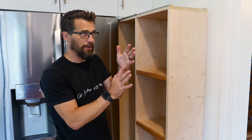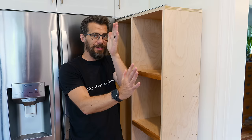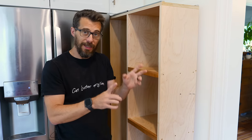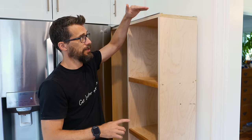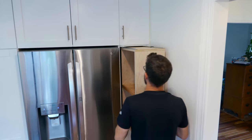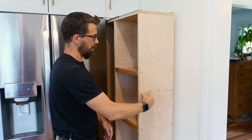I had to switch gears a little bit, and I found that having the drawer slides on the back of it allowed it to move this way and this way. And it was really hard to get all that stuff lined up and in there. So instead, I put the slides on the top, and there's actually two of them you can see up here, and that guides it forward and backward and tries not to let it turn as much. Now, the wheels in the bottom are parallel as best as I could get them, so they stay pretty well in line, and it does open and close.